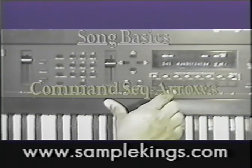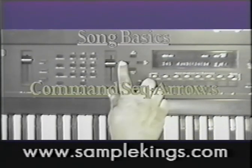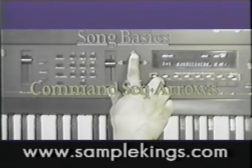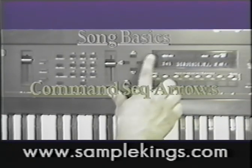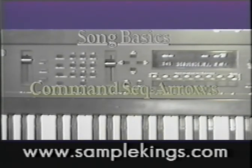For each song step you want to create, move the cursor to underline the sequence name, which currently reads undefined. Press the up arrow button to select among the sequences in memory until the display is showing the name of the sequence that you want to play during that step.